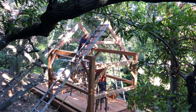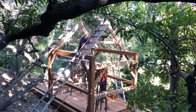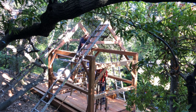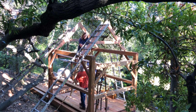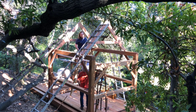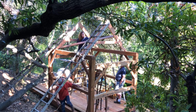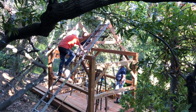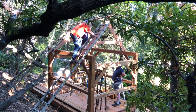The dovetails will project this way, so when you come in the entrance you'll see the dovetail joints. I'll climb up this ladder and screw — hopefully we'll do the first one on these two and then let it rip. I think you can get it high enough so I can connect it to the corner up there at the right place. I've got some long three-inch screws going into the end, but only two-inch here since these are temporary.